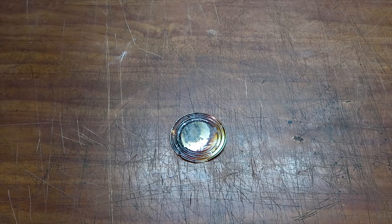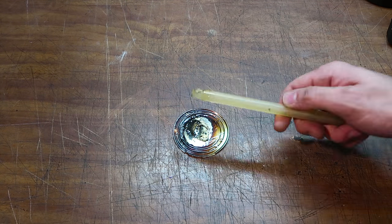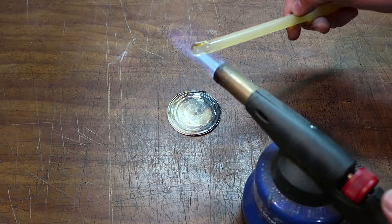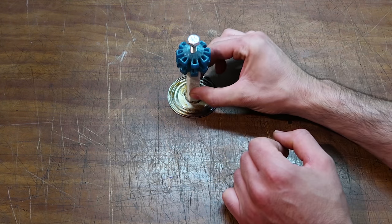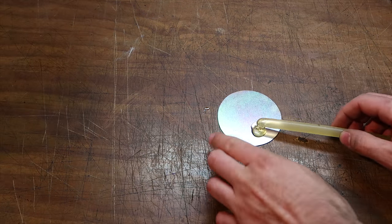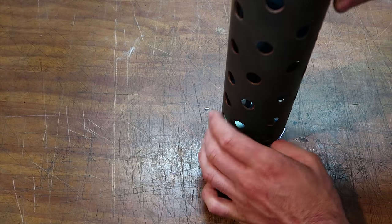Now I can start to prepare the molds. So I glue the wax parts to the top piece of the corresponding flask, again with hot glue. For the larger part, I also place the flask over while the glue dries to center everything properly.